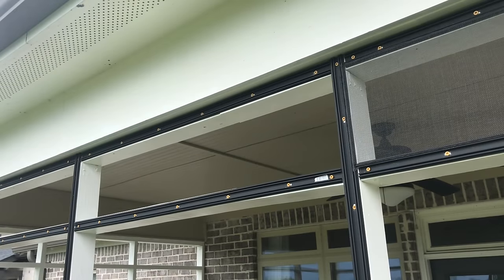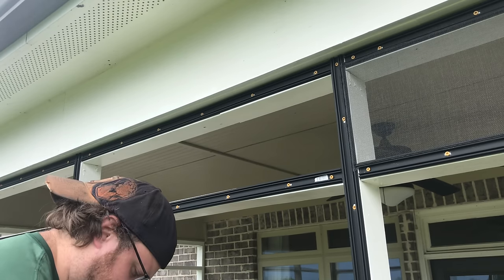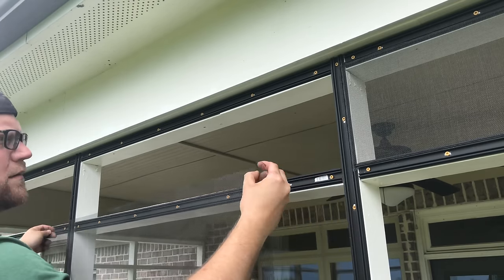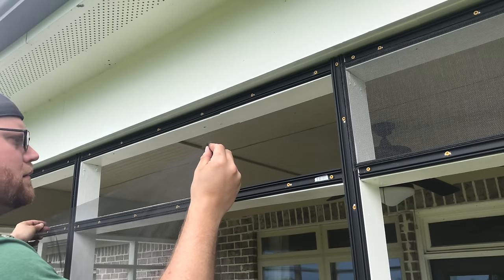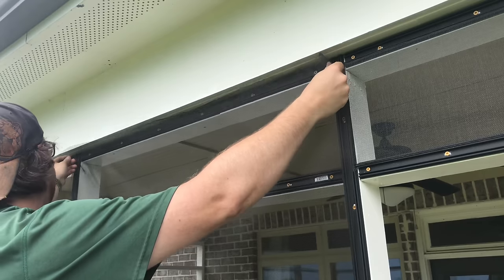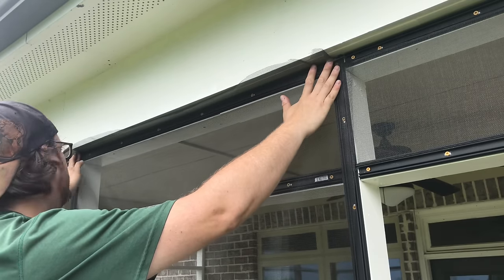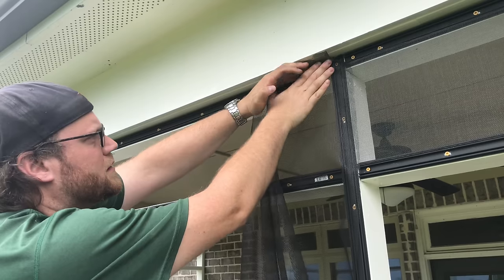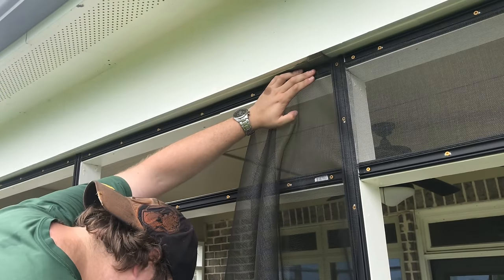All right, I think I may do two of these to show you. I'm gonna do a small transom panel up here, and then I'll do the main one. Only tools you're going to need are a utility cutter, a utility knife, a spline tool, and a box of spline. I have the box of spline at the top rung of my ladder. I'm going to do this one with a pre-cut piece. When you put this in, go towards the top, and you want at least 2 inches around every way. Just let it loose on that corner or everywhere else.